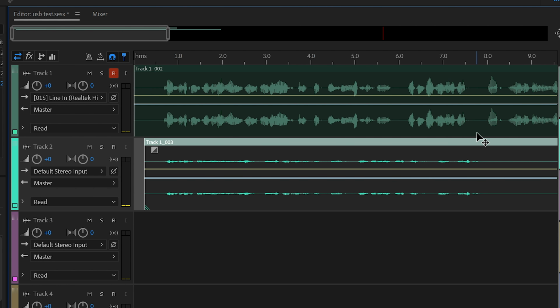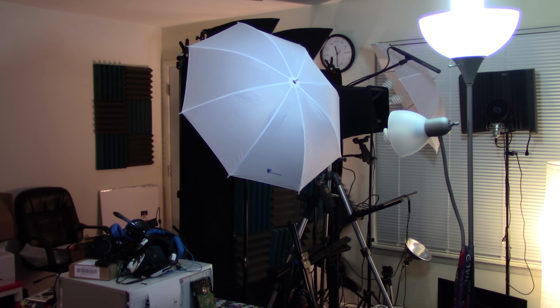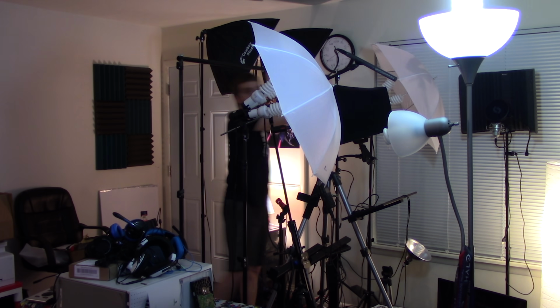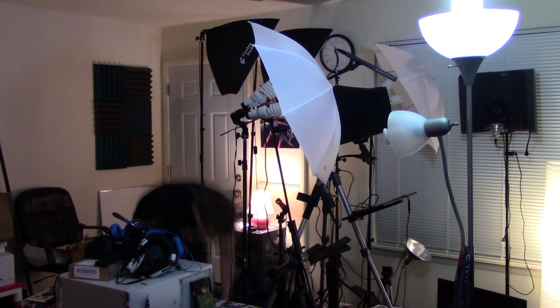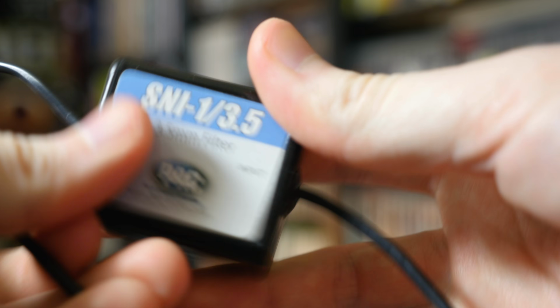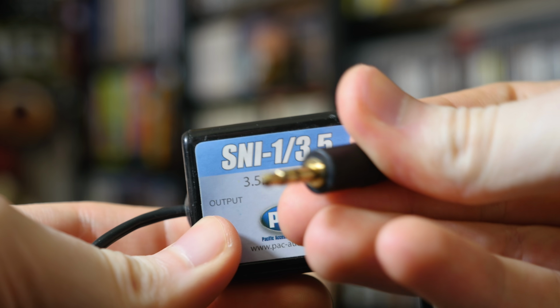Speaking of noise floors, this mixer has problems. I've spent the past 5 years trying to clear up line noise issues with this mixer. At first, I blamed my PC fan noise and spent ages throwing up those crappy foam tiles and trying to clear up room noise. Then I blamed bad power and we added more grounding pigtails to my outlets. Next, I got a bunch of those car purpose ground loop isolators for the 3.5mm runs, which helped a lot, but over time there was still some high frequency bleed from computer motherboards and things like that.